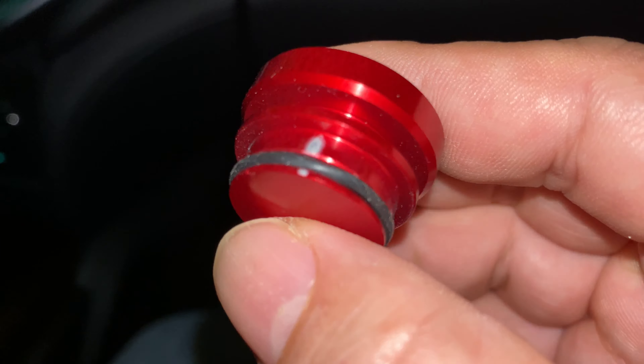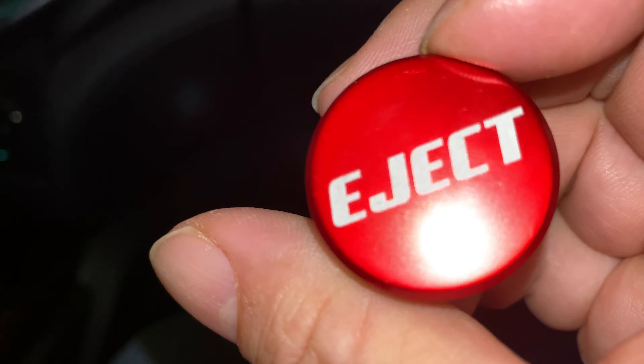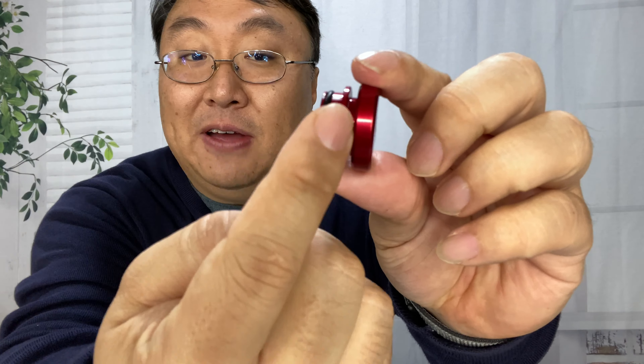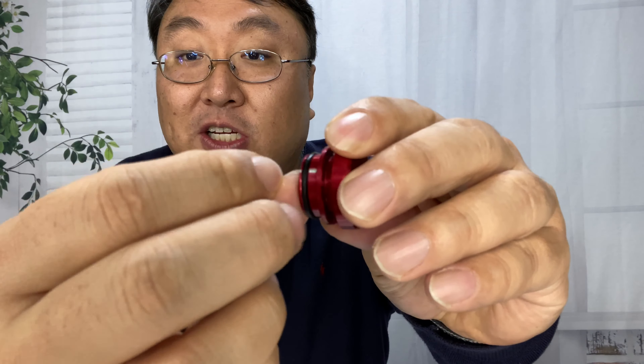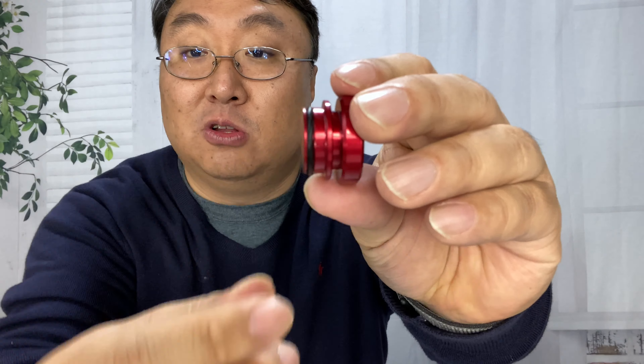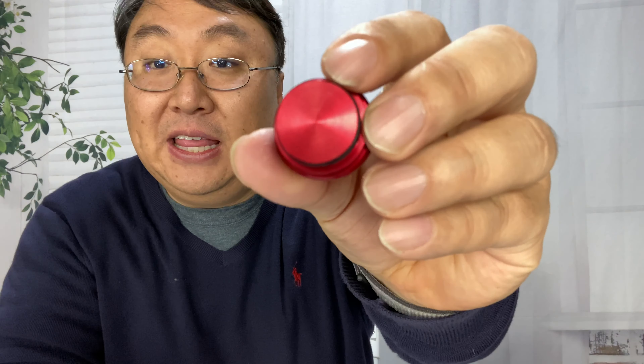As you might be able to see, it is anodized red and it says 'eject' on it in a kind of cool looking font. I will hand it to them on that. It's just a cap — really just a plug that goes into your power accessory port on your car, your cigarette lighter, your 12 volt port. What I'm interested in is how it's milled — I think these things are maybe just lathed out. We've got a pretty big cap so it looks kind of like a button, and then there's a ridge which will stop it from going any deeper. And there's an O-ring here, which looks like just a standard O-ring in another little slot. You could probably replace that. I think that O-ring is going to be what holds it in place, so it should provide a little resistance. And then it's anodized all the way around — it's kind of nice. It's got a nice little feel. The 'eject' text kind of feels like it's laser etched and then painted.